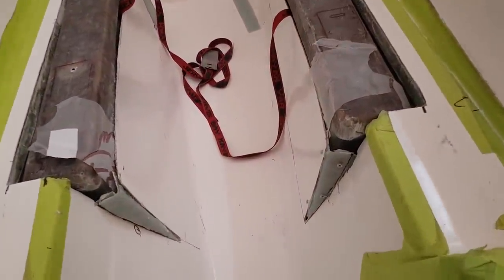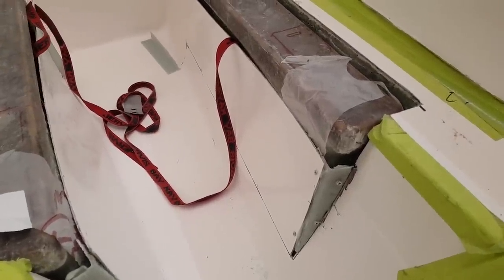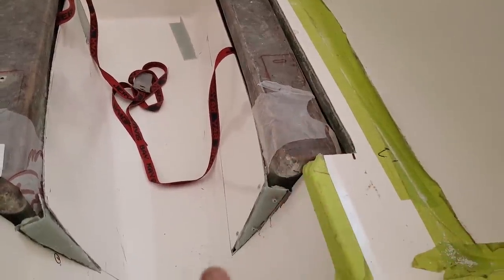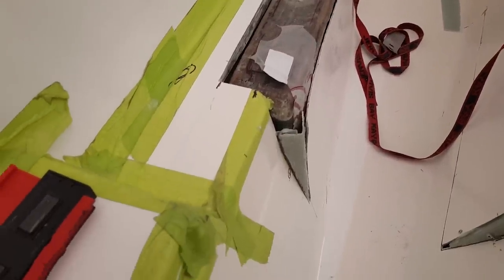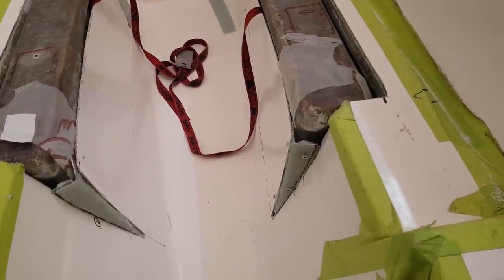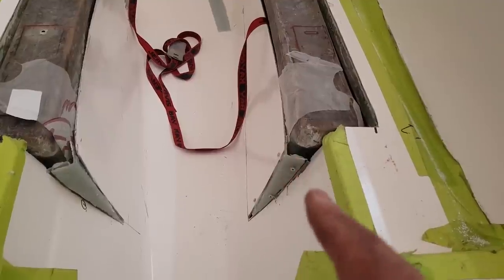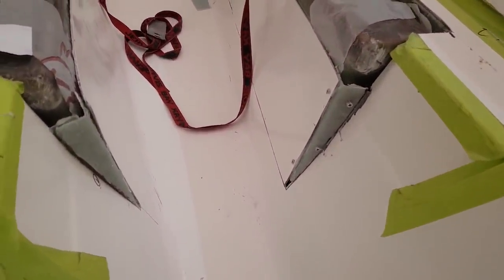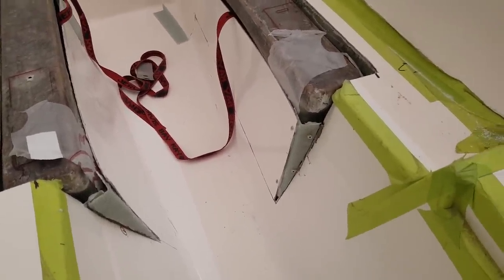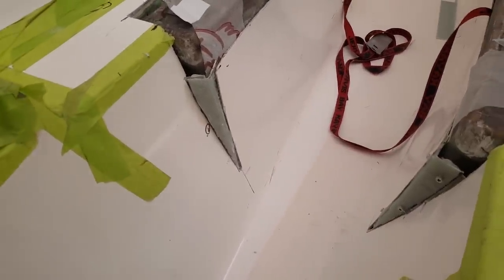I've screwed this first one and I've got epoxy on the inside gluing to the adjacent piece, and epoxy on the outside gluing to the module flap. I'll put a couple of screws in there to hold it for the night. I've got a plastic bag down underneath just in case there's any oozing of epoxy — I do not want this module locked in place. That gives me the basis to repair all the way around, then flow coat it, polish it back and make it look like it hopefully never happened.